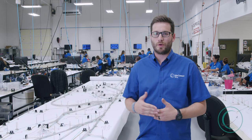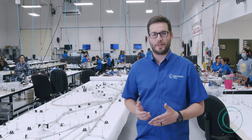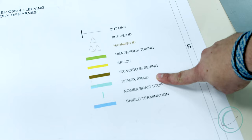Each of the wires will be broken out into different branches and breakouts. Some are a little bit more difficult than others — some take 90 degree or 45 degree turns, so we have to be able to route them correctly. That's why we place these magnet posts in order to be able to bend the wires around in the direction that they need to be headed.